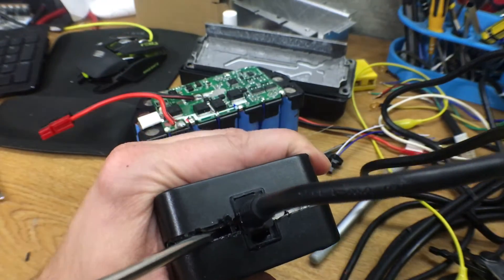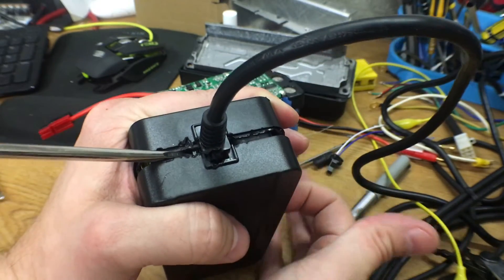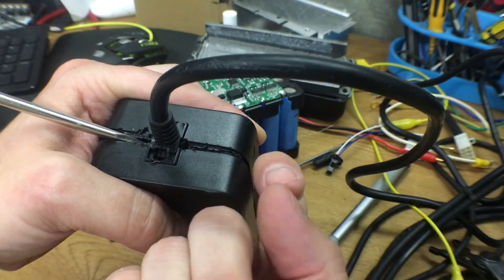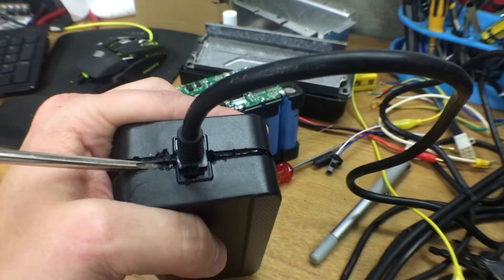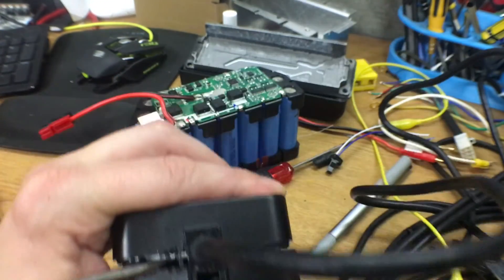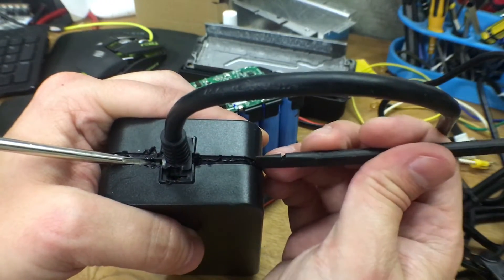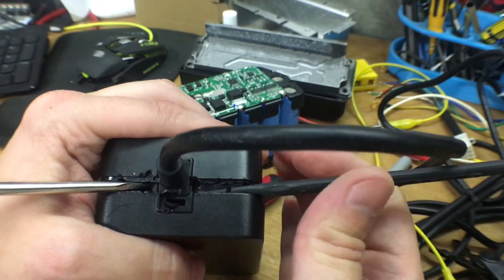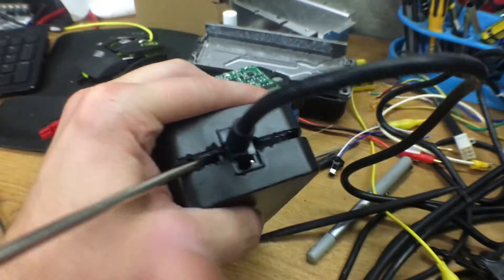You'll be tempted to hold it open with your fingers — do not do that. Some of these are really strong and there's a lot of tension where it's still connected. If it snaps shut, you can pinch yourself really badly. Use inanimate objects. Have lots of little wedges and be mindful not to ram something in and pierce a capacitor. Stick a couple of objects in there, check clearance, and continuously wedge — wedge, wedge — you'll hear pop, pop, pop, and then you'll be in like Flynn.